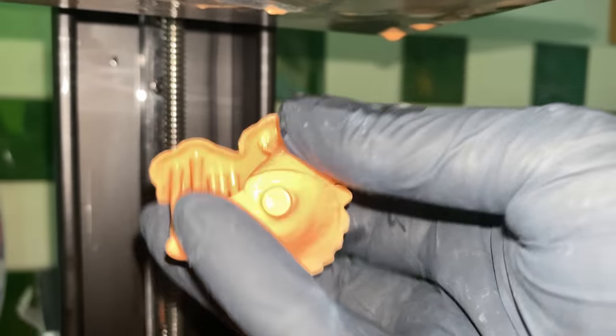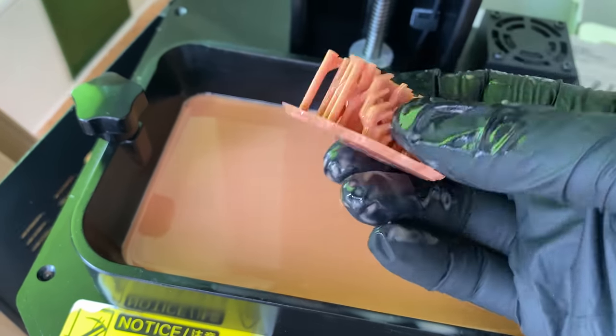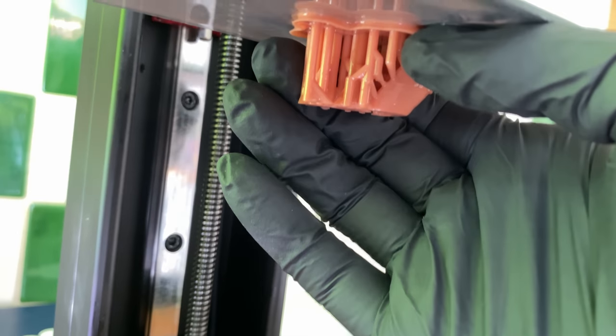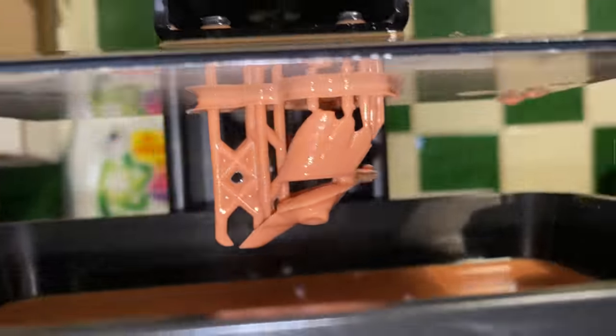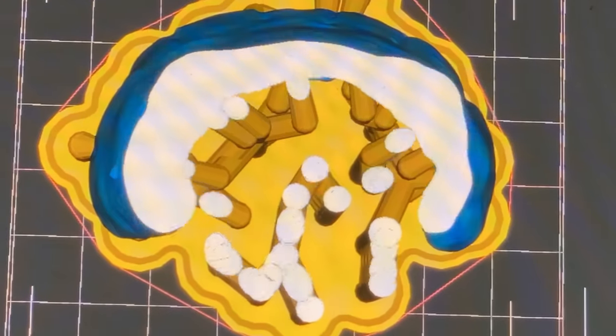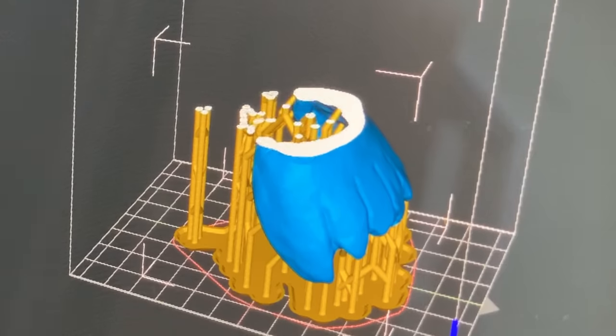Oh dear. Well, it got partway there, I suppose. I just couldn't seem to get a good result. Sometimes the object would print with a whole bunch of splits in it, and sometimes the resin would stick to the bottom of the vat and you'd end up with this kind of pancake-style Dabchik head. I think the problem in both cases was adhesion. Dabchik's pancake head was a result of it sticking too firmly to the plastic film, and the layer wasn't able to be lifted up. In the other cases where you get those splits, I think that's because the resin isn't sticking together. I was able to come up with a solution that did work — that was by really bumping up the exterior supports on the object. If you have some experience with 3D printing, this is going to look utterly ridiculous, but it did the job. But it only did the job once. Every other print I've done subsequently has also failed, so I still have a fair bit to learn.